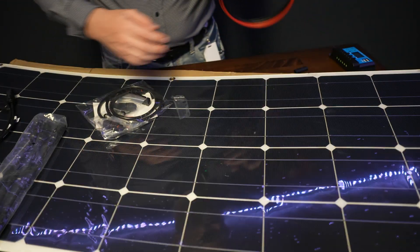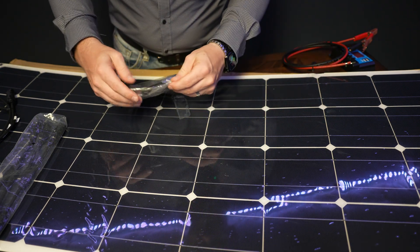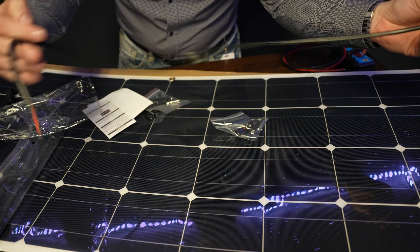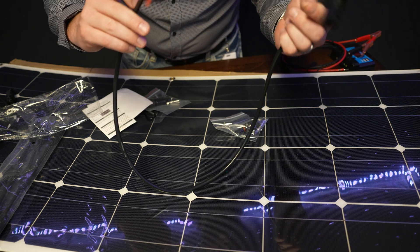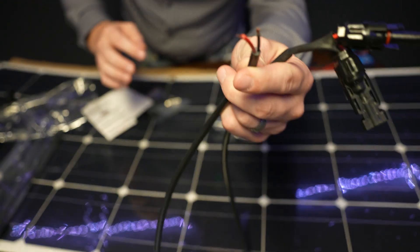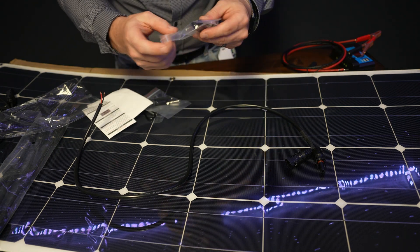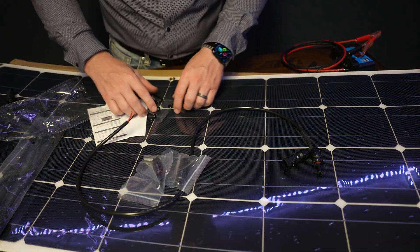You've got a jumper cable here with bare wire on the other side. Let's open this up — this is an interesting design. So you got this wrapped and you think you've got a thick, beefy wire, but you really got really thin wires here coming out. They're not super big. You got your positive and negative wrapped together — I don't think I'd trust that one. But then you've got your MC4 connectors here that you would presumably need to attach on that side, depending on what you're doing.